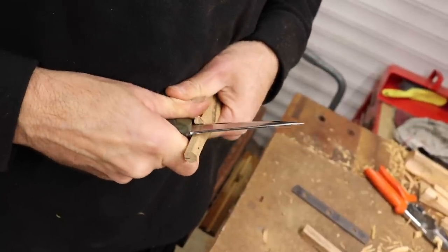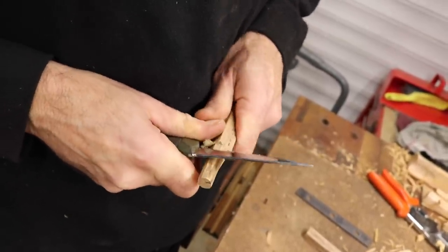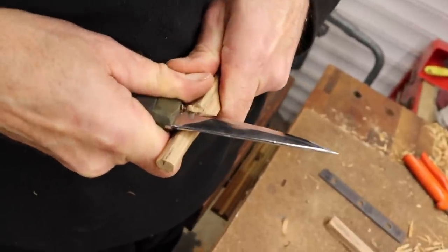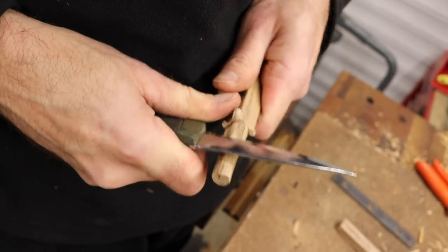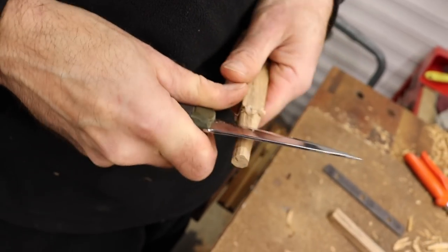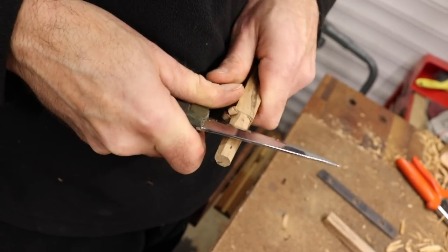So then we're just bringing that back so that it gives it somewhere to finish on the dowel plate. So where we went round, we put that little release cut in. Effectively, it allows these little slivers of timber to come off without sending a split further up here. Is the idea.